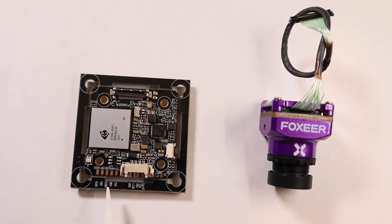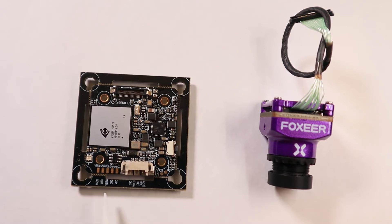On the left you got your solder pads: you got your VCC full power, your ground, your video output, and your OSD output. Further on the solder pads you got your voltage sensor — this is not included in the connector, which is a little bit strange. On the connector, almost the same as the solder pads: from right you got your power, your ground, your video output, and your OSD. You can see the OSD connector wired to this connector, and you can plug and play like this.